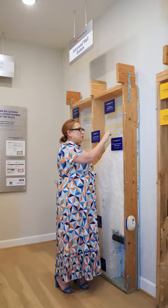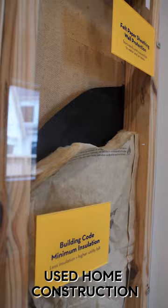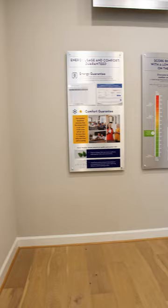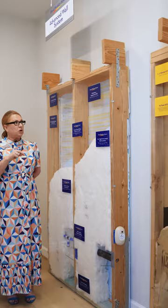The frame has to be wrapped with something before the brick goes on. We wrap with a foam board that's rated for this humid climate. With humidity and water, a lot of builders will still wrap their homes in paper — and what's going to happen in this humidity with paper? You open yourself up for mold. We wrap our homes with the foam board, which also gives you another R-rating of 3. Paper and cardboard do not give you any more insulation. So a 2x6 wrapped with this foam board is R22 for the exterior wall. A 2x4 wrapped in paper is R13 — almost double the insulation.